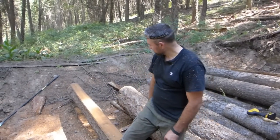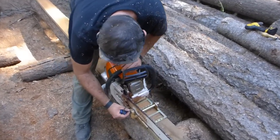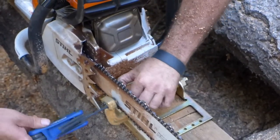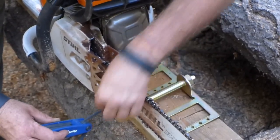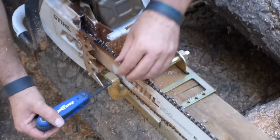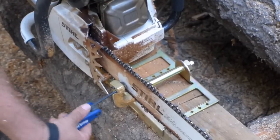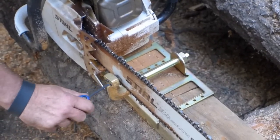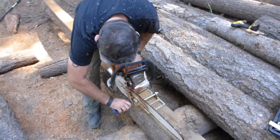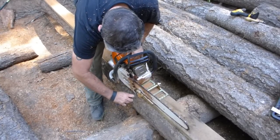What I've done here is I've got a 2x6, I'm ready to go here. We've screwed it down. I'm going to attach the chainsaw to the lumber maker now. Basically we've got these three little set screws over here. The trick, as per the manual, is to get the outside set screws snugged up first and alternate snugging them. Just FYI, with the lumber maker you will get an allen key, but I've actually managed to lose mine today. So we're just going to alternate tightening them with small little turns at a time. You don't want to crank down on these too much.